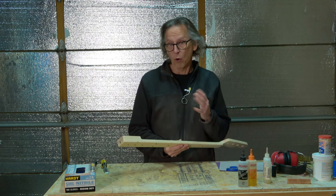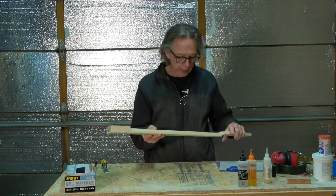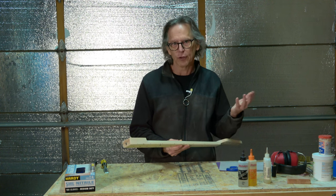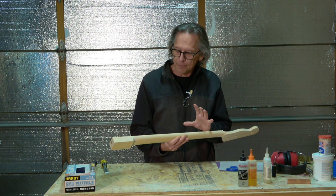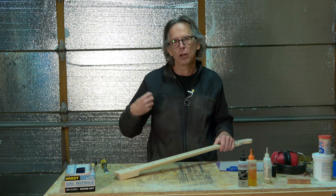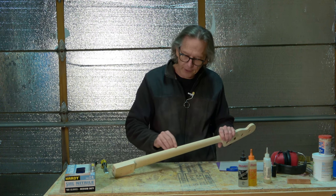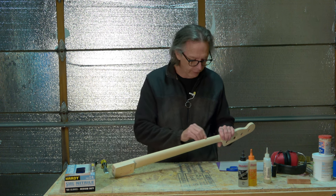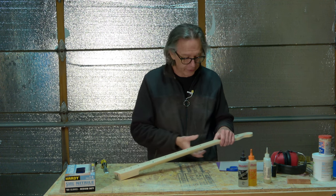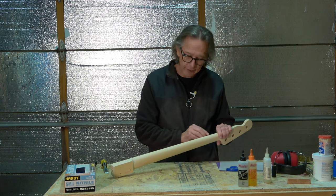All right guys, so I'm ready to start sanding, or am I? Actually, before I do any sanding work, I want to examine the neck and assess it for any potential problems that sanding isn't going to fix — like a knot or a gouge or a glue seam or something like that. In the case of this neck, when I glued the fretboard down to the neck, I wasn't able to use a clamping caul like I normally use. The advantage of using a clamping caul is it will prevent the appearance of a visible glue seam where the fretboard meets the neck. Since I didn't have a caul that would work for this neck, I just simply clamped it down, placing the clamps directly on the surface of the fretboard. As a result, I had a visible glue seam.